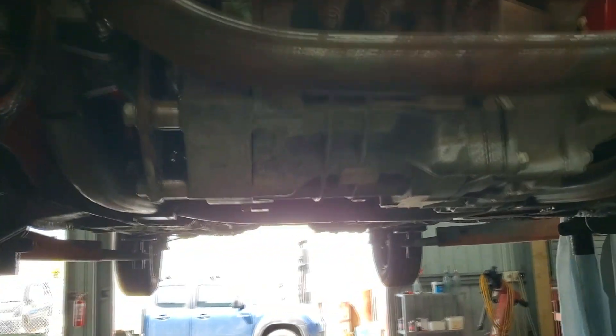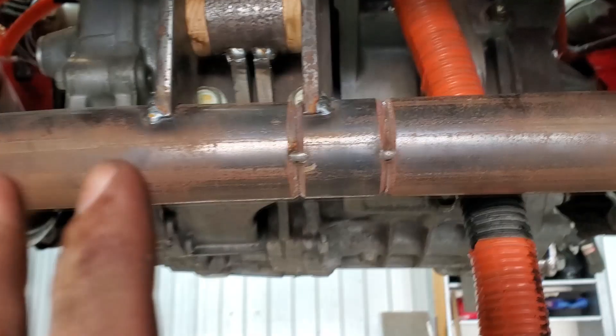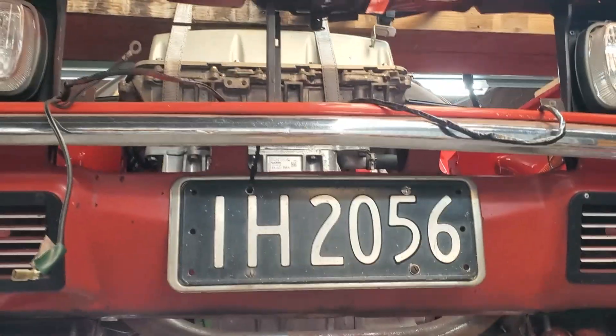Now I just need to - this is going to be weird - I need to take the motor out from the top. Taking the bolt out of there, bolt's out. Taking both the CV shafts out, got this cable hanging down now ready, and that bolt's out. I'm going to lower it down and sit it back on the blocks. I don't want to completely take the weight off and have anything go wrong because everything is still just tacked together. The whole idea is to be able to weld it properly outside of the car. I'm going to sit it down on the wooden blocks and then get the engine crane and lift this out. That's a big move.